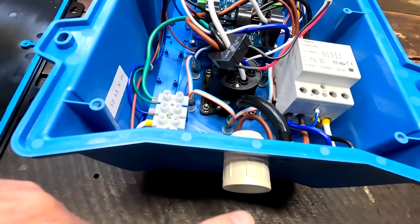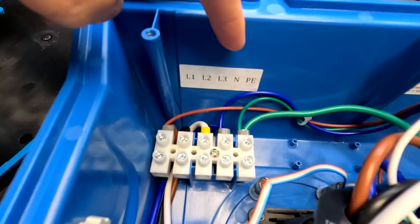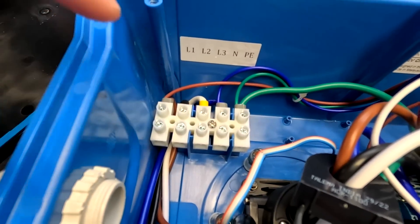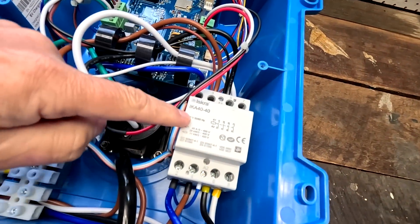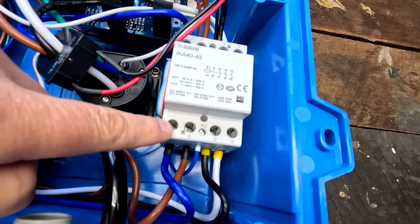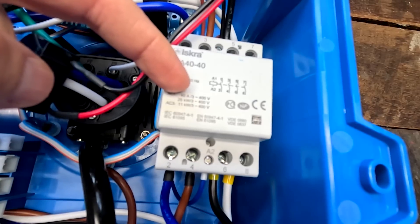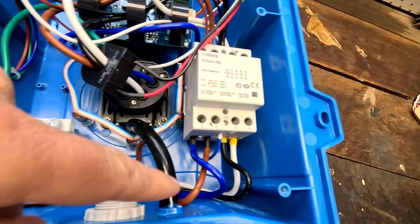There's a bit of a design flaw here: the cable entrance is only at the bottom with no other entry option. We've got a three-phase connection — neutral and ground. The station can be operated via single phase at 7.4 kW or three phase up to 22 kW — that is fast, though not sure if people actually need that at home. The next thing we found is a huge four-pole contactor, switching all three phases plus neutral at 400V three-phase up to 26 kW or 40 amps.